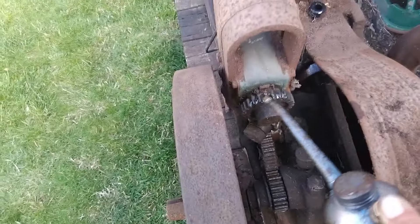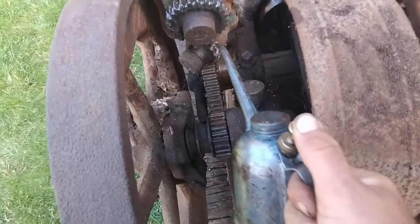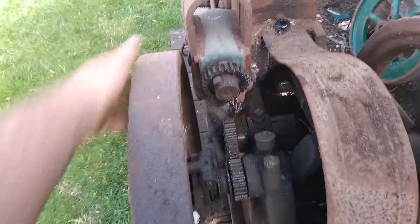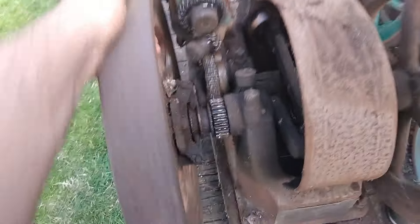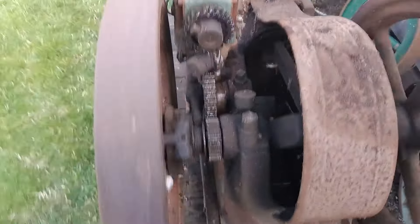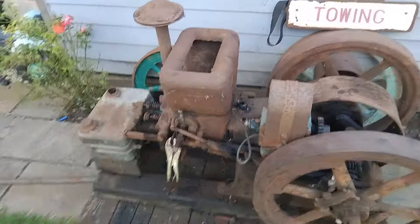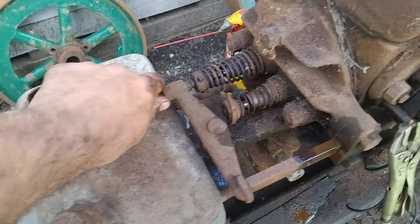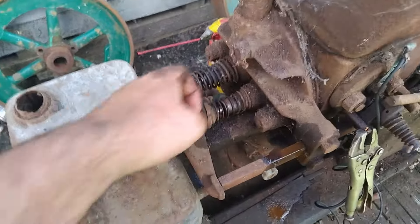All these gears are very dry. I'm not going to try it with the magneto - I've got an old low tension coil that we can stick in place of that for now, just so we can rule that out as a problem. That definitely has got compression for sure. We've gone round giving it as much oil as we can, and all the moving places - valves are free, rockers are free, push rods free as you can see.